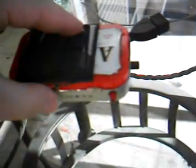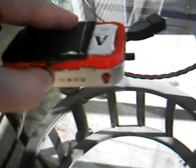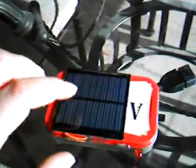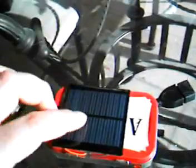To show you an idea, I'll turn it on — get it in the dark — and it'll blink. I got a blinking LED just because I like the way it looks. And that's essentially the whole deal with your Altoid solar charger, but you have to make sure you have at least a 6-volt solar panel.